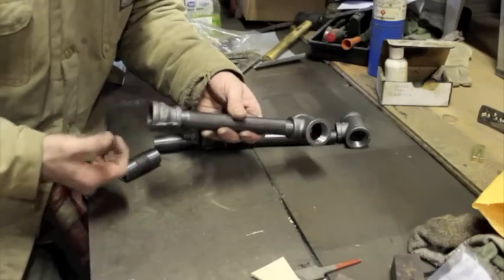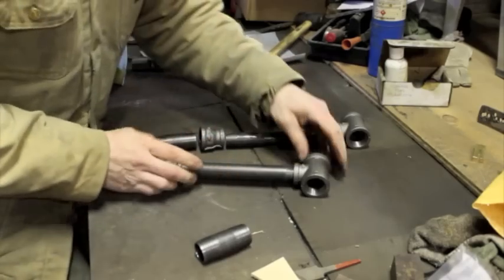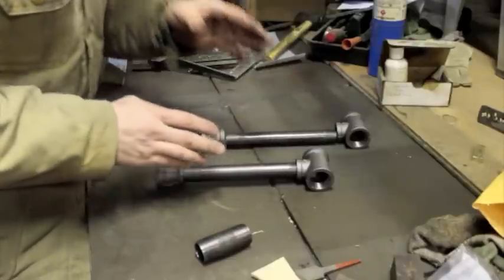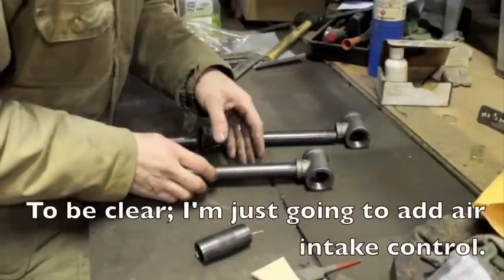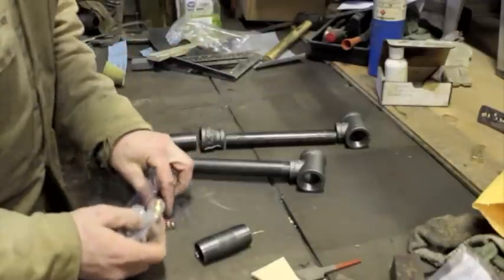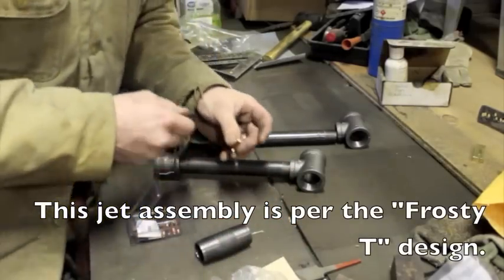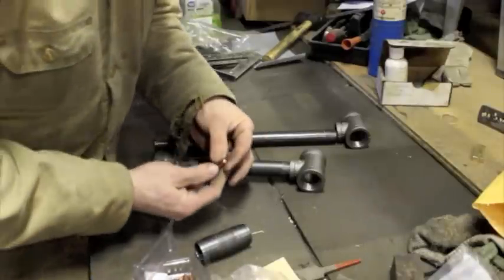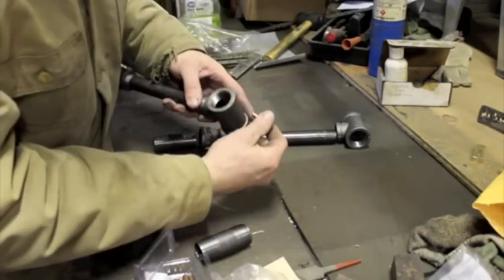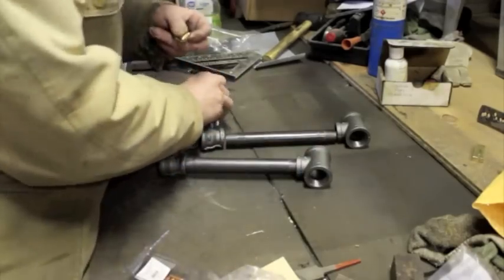This is the end that is going to be ignited in the forge. There are two things this design of burner does not have that I would like to see, and I'm going to correct that one thing — I'm going to add airflow control and nozzle adjustment. The jets we're going to be using in this burner is an assembly of some fittings and a MIG tip for a MIG welder — 0.025 is what I'm starting with. That's going to sit in here essentially in the center and shoot the fuel down through there.